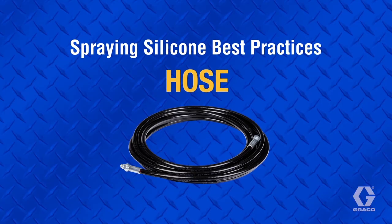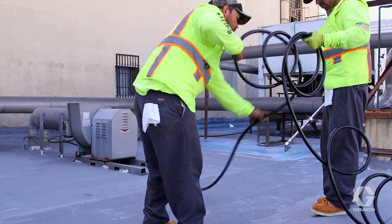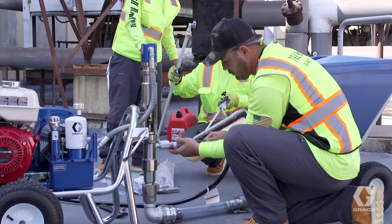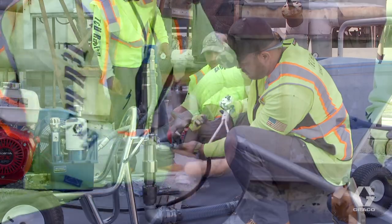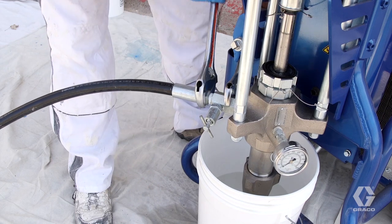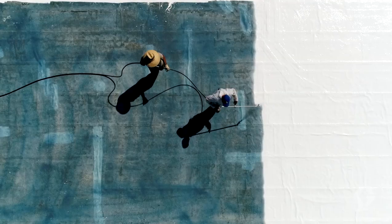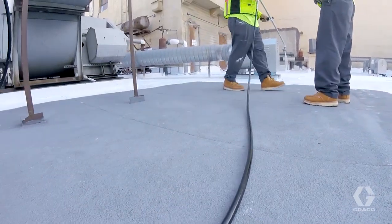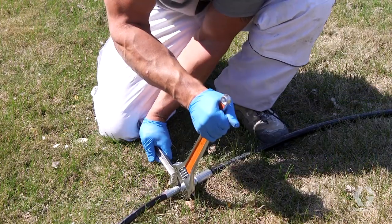To minimize pressure loss, always use an appropriate high-pressure rated hose with the largest diameter possible. As with all spray materials, the larger the hose, the more pressure that will be available to atomize with. Connect the hose to the unit, gun, and other sections of the hose, and torque connections at 90 foot-pounds — this is typically a quarter turn after the surfaces make contact. Keep previously used and flushed hoses full of virgin mineral spirits and cap the ends for long and short-term storage. Temperature, movement of hoses, and pressure can affect tightness over time, and leaking will result in damaged hoses and fittings, so check connections periodically throughout the day.